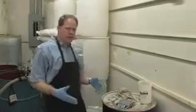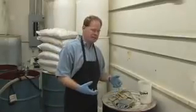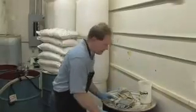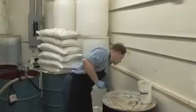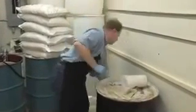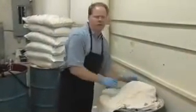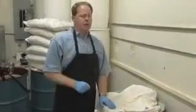One of the things we do after we're done with our catalyst is we seal everything so we don't let it get moist. So I've sealed my catalyst bucket back up. I'm going to put a towel over top of my scale to keep it nice and dry. I put this inside here, keep it dry, and I cover everything. So I don't want moisture getting on there. Our next step is to put more methanol in the machine. We'll get the batch started.